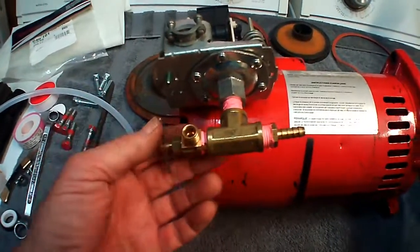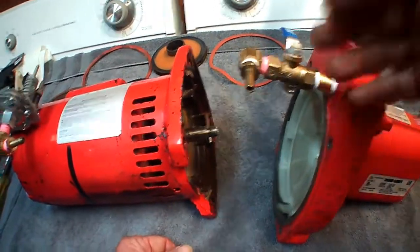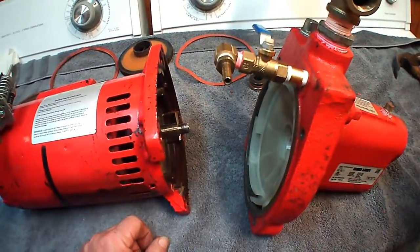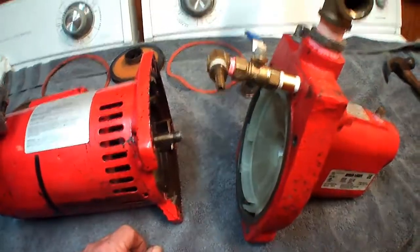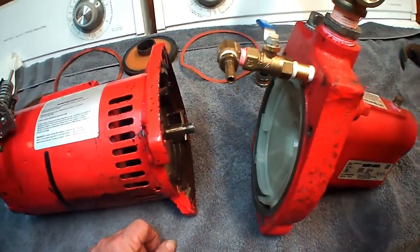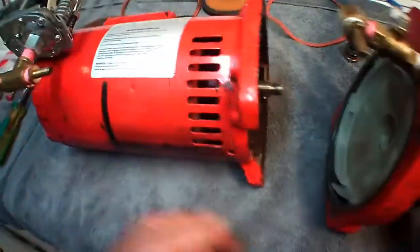Everything under my house is either PVC or brass — all my fittings, all my couplings, except for the pump itself. I'm sure someone's going to ask where all the rust in the pump came from — no, my entire system, the check valve, all the pipe, everything is PVC or higher-grade plastic or brass. There is no steel between my water storage tanks and the pump. The main water comes in through a large brass fitting with the check valve — the one-way flow valve — and then goes directly into the plastic system. So we are ready to put this thing back together.